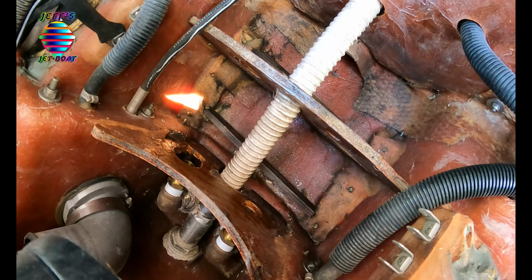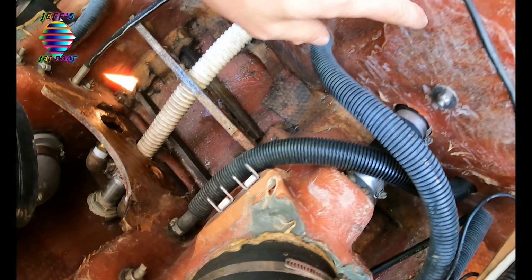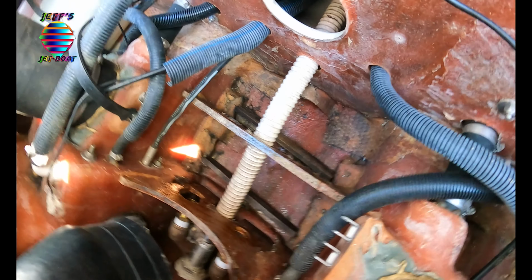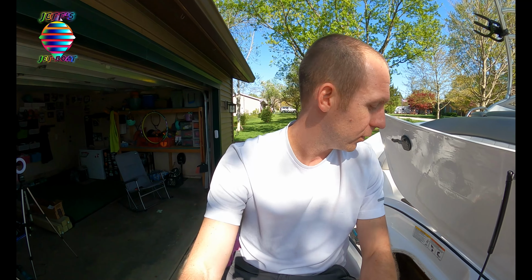and then that's it. So what we're gonna do is I'm gonna let this sucker dry overnight, come back out here tomorrow, and then we'll go ahead and we'll drill the holes and get the pumps mounted, and then run the lines to the bags, and that should be it. Again, we're gonna let everything dry, and come back on the next video and mount the ballast pumps, run all the fill lines and everything else. I will also fill this engine bay up with water and make sure that nothing's leaking out around those fittings. And that should be it.